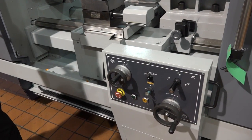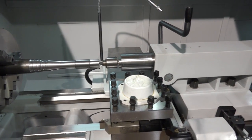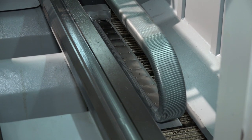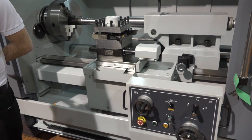You mentioned a bigger machine — you've got the 800 as well, other models? Yeah, based on this frame we're going to be able to offer it with an 800 swing available within a couple of months. I quite like the access — you've got two doors and you can also open the doors at the back of the machine. We've thought about it long and hard and had a lot of involvement with the manufacturers in terms of usage and ergonomics. People like a very open type arrangement which makes it very flexible. You've got 102mm bore capacity with a 16 inch chuck, and the three stage gearbox gives you most aspects needed for heavy cutting. This machine is here and readily available from stock along with all the other models right through from the smaller machines.